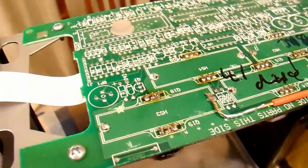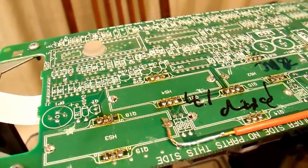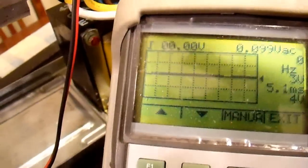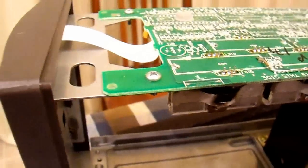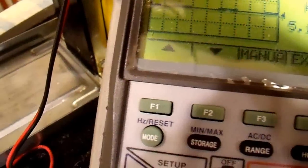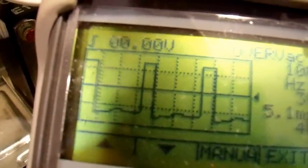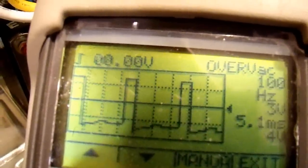So something went wrong when I shorted this thing out. I poked around a little bit and did find the problem. I'm going to see if I can demonstrate it here without blowing it up completely. I have my multimeter set on its oscilloscope function and I'm going to probe the gate of one of this bank of FETs and the gate of one of the other bank of FETs. The gate is what tells the transistor to turn on and off. So this is a good one — that is what it's supposed to look like. It goes to about 12 volts, and that's the bank of FETs that's staying cool.